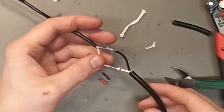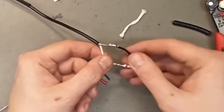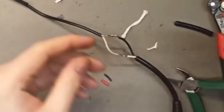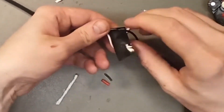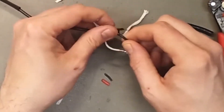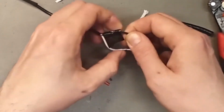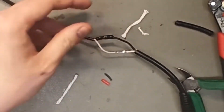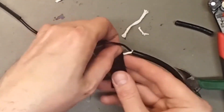That's good enough. You can have extra insulation here and here where you pull on them, but I prefer to use electrical tape. If you have heat shrink tubing here and here, it may be damaged when you solder and then you have to redo everything. Electrical tape has never failed me. It also ends up being about five layers, whereas heat shrink tubing is just one.